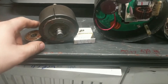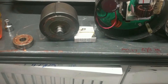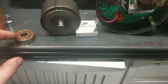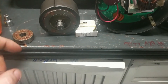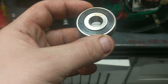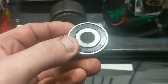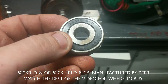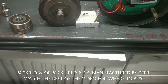The dimensions are 40mm by 12mm with a half inch shaft. It's a specialty bearing. That BB-10321 is a customer part number for a 6203 bearing with a half inch bore. This is a 6203 RLD-8 — it's the same bearing, different brand.